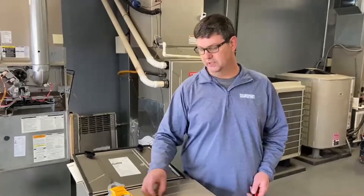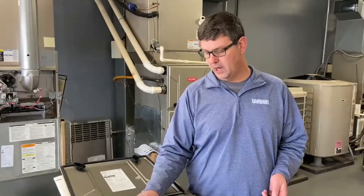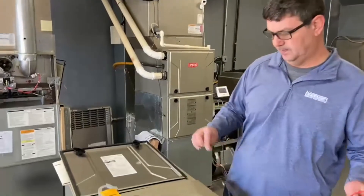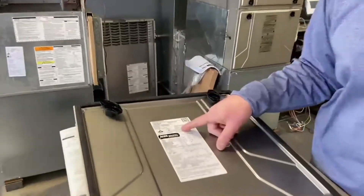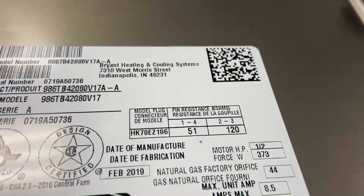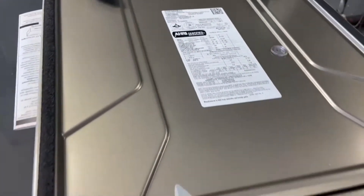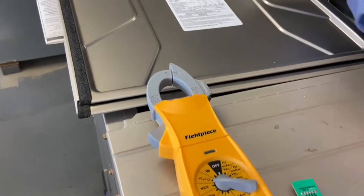To check this, we simply set our meter to read ohms in thousands of ohms. It tells us that between pins one and four we should have around 51,000, and between two and three, 120,000.